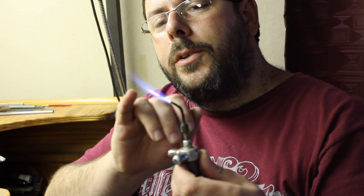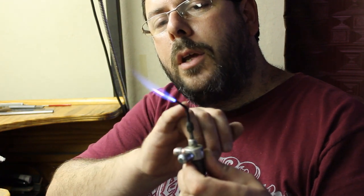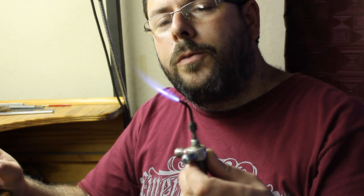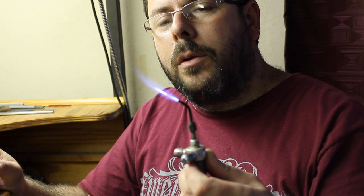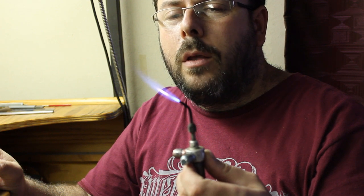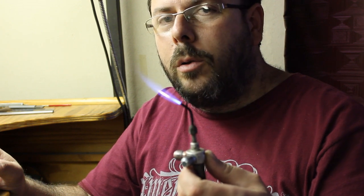You'll notice the slight yellow feather still present in the flame — this is a reducing flame. You can use this for soldering on some gold and silver, although you might have a little bit of problems with heat control.